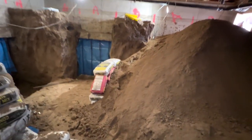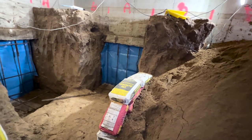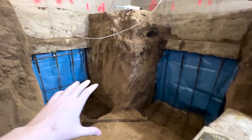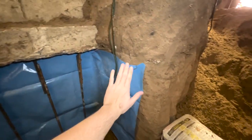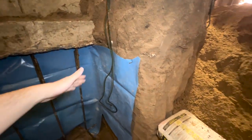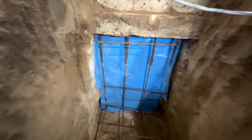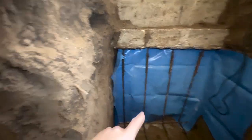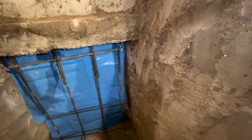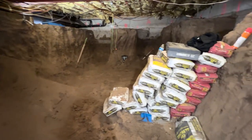As you can see from last week, they have their footers here that they're getting ready to work on. They've got the rebar in, some vapor barrier put up against the back, and they do a little overhang on some of these sections — because once they remove this mound, they're going to flip this back so it doesn't have any holes. It overlaps with this section, whereas this one is flush. The section where the mound is will have an overlapping section that wraps on top so it's nice and flush.